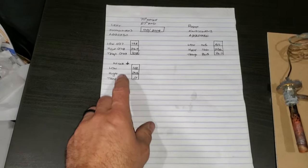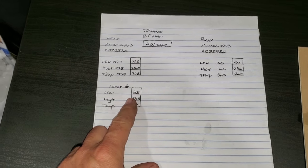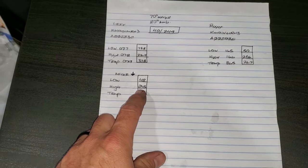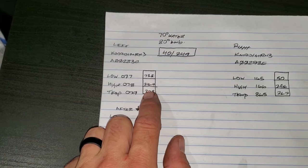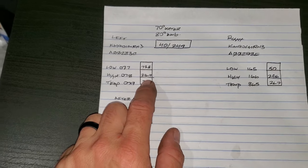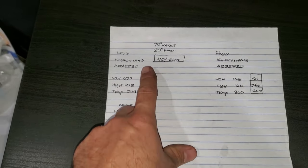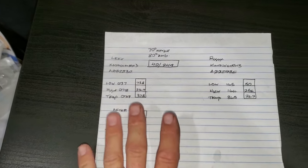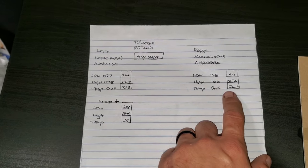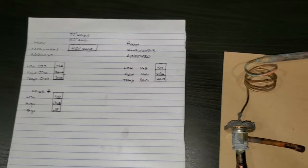After the fact I had written down my pressures. We were running 48 back and 245 head, compared to what it was the first time — 73 back and 216 head. Pretty close to the factory recommendations. Some numbers are a little bit skewed but my outdoor ambient was also a little bit lower, so I'm not too worried about it.